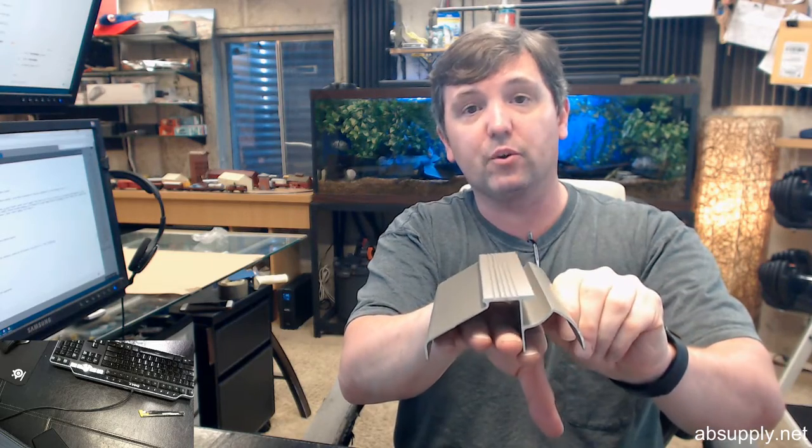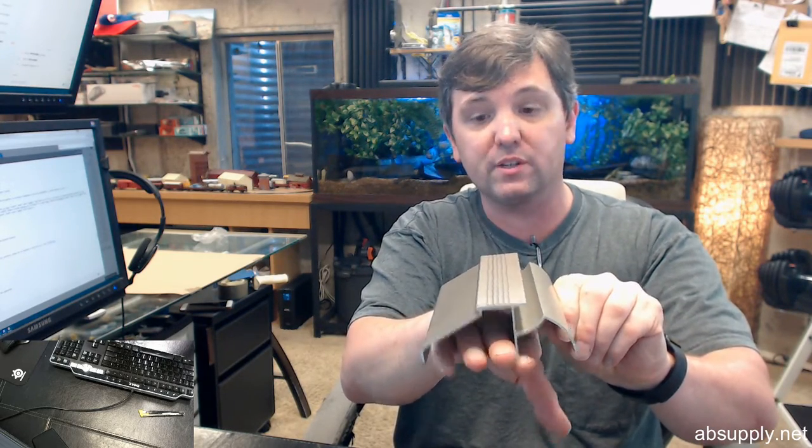You don't want it sitting on top of your limestone sill or your wood structure, whatever it is, over years. That would certainly corrode or work to corrode the bottom of your sill. I do not suggest buying an aluminum pan with a bronze threshold. You can do solid architectural bronze from Pemko. You shouldn't mix dissimilar metals. That's basic. There is a big difference between the cost of a brass water pan and an aluminum water pan, but I'd have to technically argue that they would not really warrant an application where you were using another material, I should say, compared to the threshold. I would think that would go both ways. Aluminum, stick with aluminum. Architectural bronze, stick with brass.